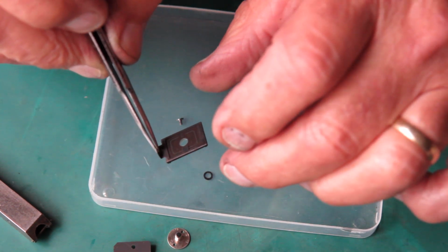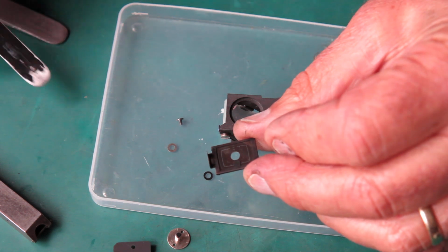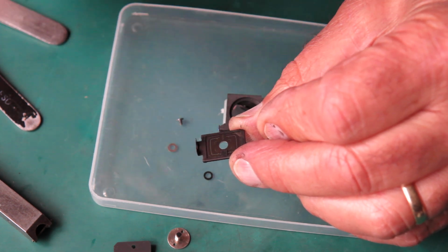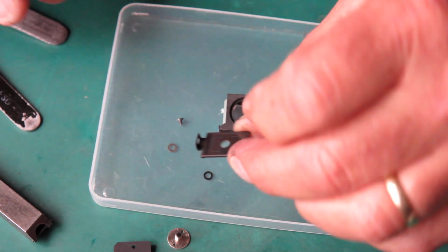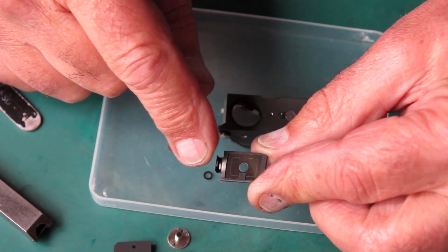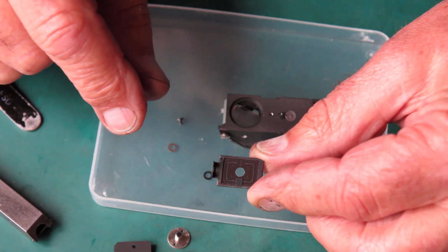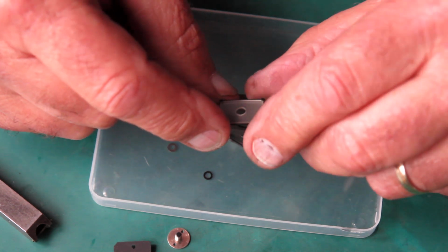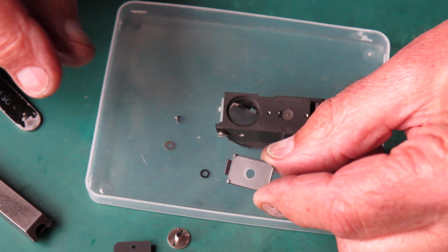But you can paint those out. Anywhere you've got a bright line that you don't want, you can get the end of a needle or the end of a sharpened toothpick, pick up a dot of black paint, just dot it on that piece that you don't want, and you won't have that bright line showing up. I've used that in the past where people want the other frame lines knocked out of their finder, where they have no intention of using the wide angle or the telephoto lens, just so that they're not there as a distraction in their finder. It's a one-way process. If you do paint them over, the chance of you getting that paint off afterwards without damage is very minimal.